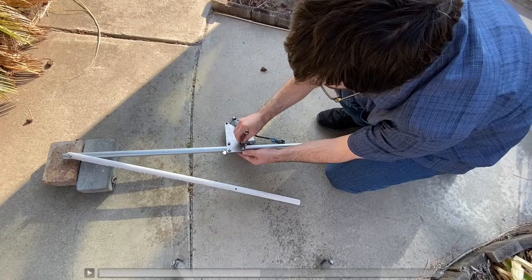Okay. So from here, depending on how much movement you want, if you wanted to bring this a little bit more down, and then have a bigger cam arm, you can actually have the movements go even further. Bringing that motor mount and motor higher up on the pipe is going to create less of a distance here, and that way it's going to have less movement. So this is kind of a happy medium area right here.